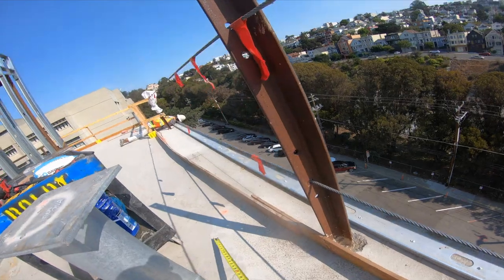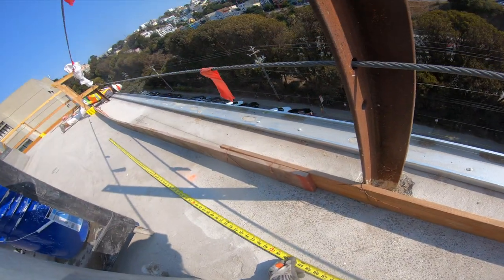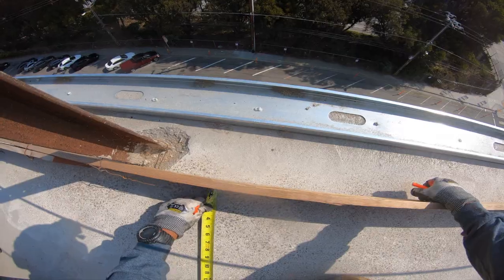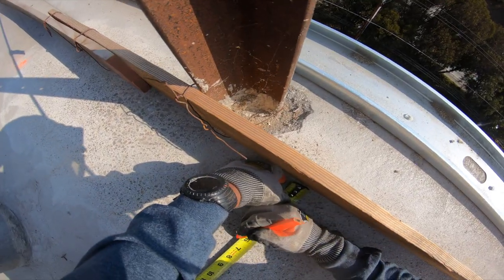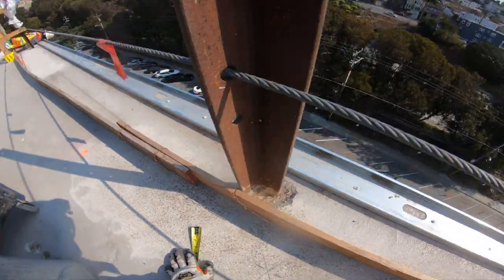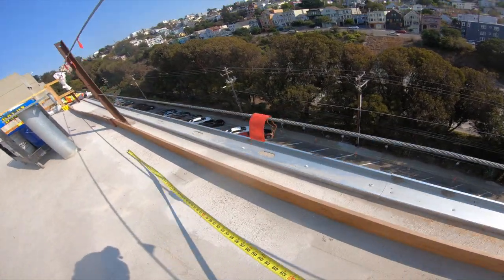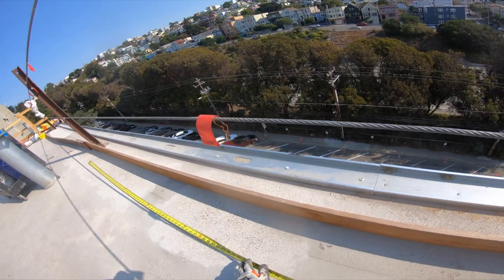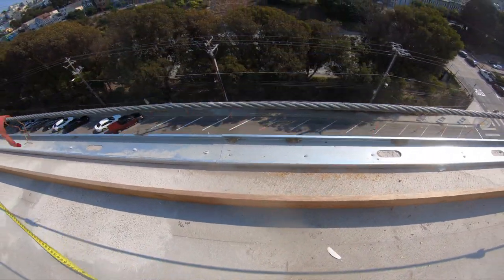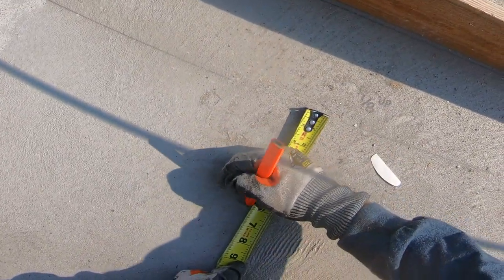Here I'm taking measurements — seven feet nine inches — and marking an X. This is where I'm going to put the handrails. From that line, six inches, making two lines and then an X. I repeat that same process from where I marked that X — another seven feet nine inches. Then after that, get a line six inches down from that line.